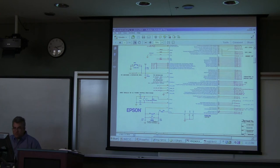12. I'll have to look. We're at 12. So it looks like the processor has a quadrupler for the CPU part of the processor, and the peripheral clock is running at 24 megahertz. Interesting. Here's another clock crystal. 32.768 kilohertz. Why do you think that's there?